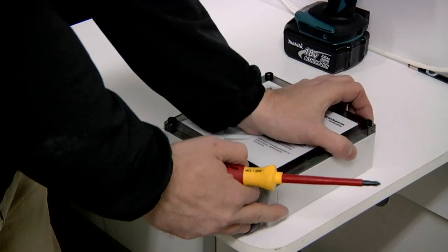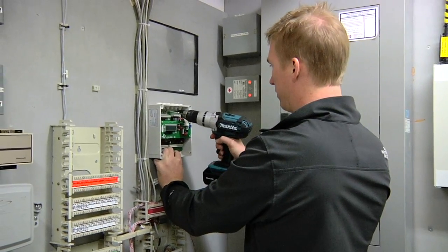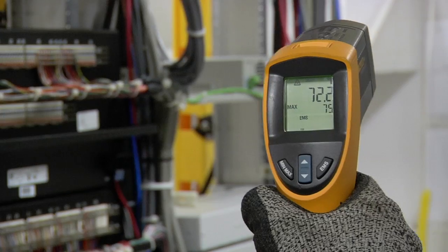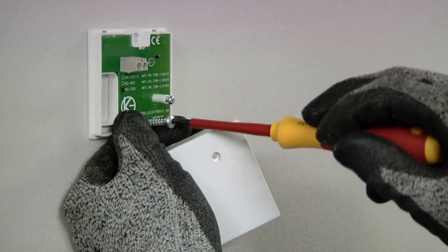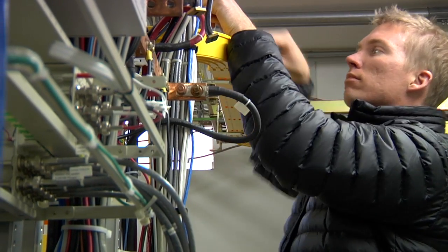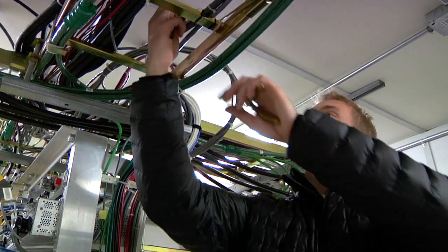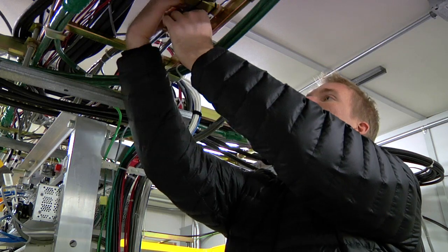Now you are ready to mount the controller and sensor and run wiring. First, mount the controller to the wall near the existing AC controller or communications board. Using an IR thermometer, locate the hottest and highest spot in the shelter and mount the indoor temperature sensor. Next, run all the wiring over the cable trays from the selected placement locations, including the exhaust damper, indoor temperature sensor, and the controller. Make sure you also zip tie any loose wiring to existing wiring on the cable trays and against the walls.